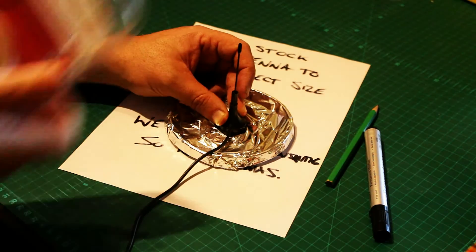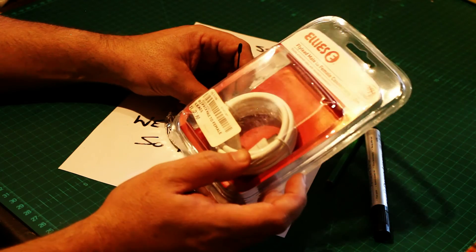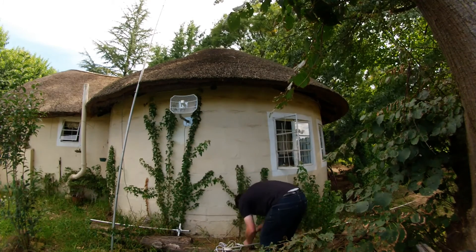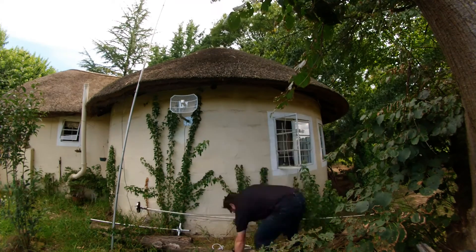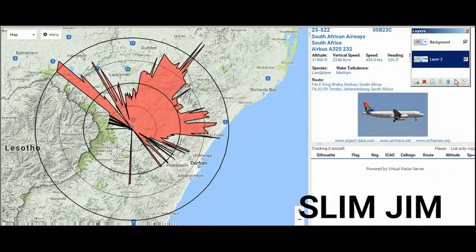I'm going to extend the range by putting it up higher, using TV extension cords — again, it's subpar, but it's all about keeping it simple. A quarter wave on a stick is as simple as it can get, and we'll use it again — there's a reason for making that quarter wave. It worked out to about 60 nautical miles. You can clearly see where my reception comes from. The Slim Jim is much better — much better low-angle or further-away reception because of the higher gain.